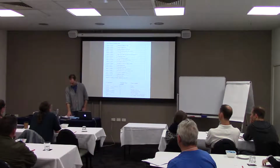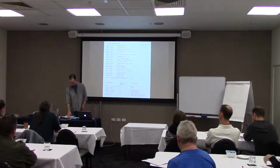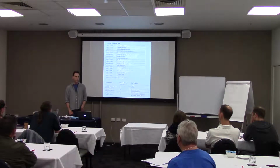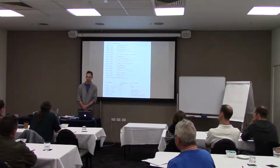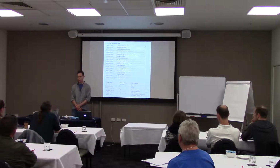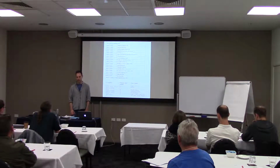And also under copper-based alloys, you've got brass, bronze, and nickel brasses, which are our German silvers or nickel silvers. Generally, the ones we work with are 18% nickel added to brass. So we've got copper, zinc, and nickel content of some sort with some other trace elements. And they are hard to find. You can buy them in sheet here, or from the States, but it's really hard to find bar stock.